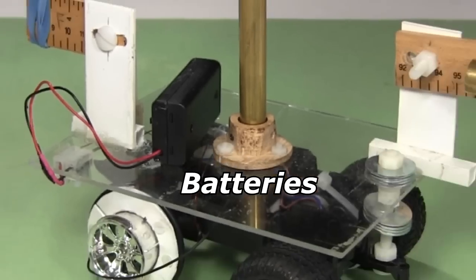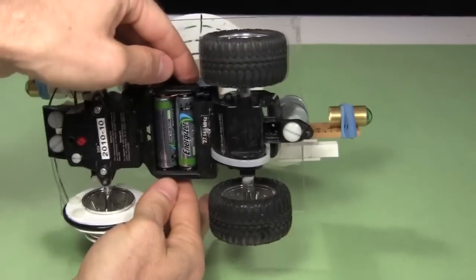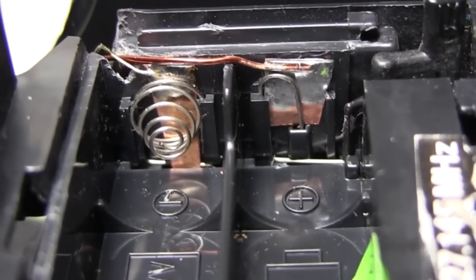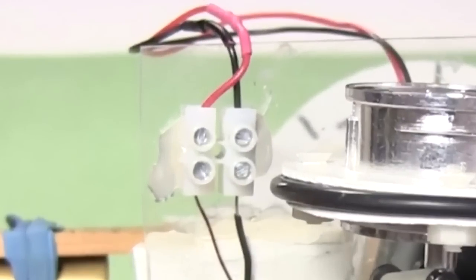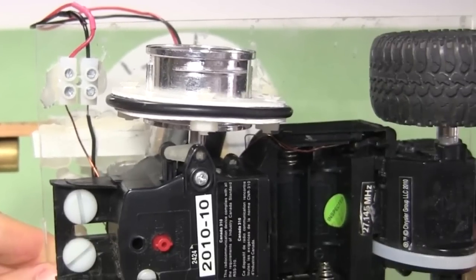You may also notice this battery pack. The truck originally ran on just two batteries. To get a longer run time without charging, I decided to add two more in parallel. I slip some thin copper plates in at the positive and negative outputs, hot glue a battery case on top, and then use a terminal strip to connect both sets of batteries' negatives together and the positives together.